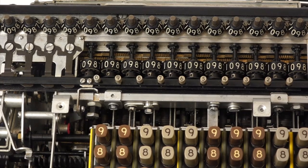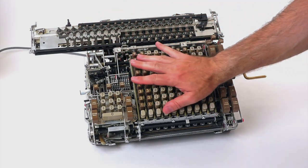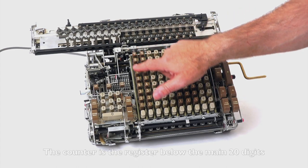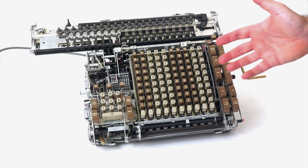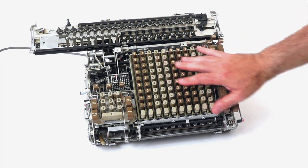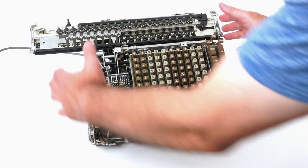This is very satisfying. The first thing to notice is that there is a different number of digits in the different sections of the machine: 20 digits in the accumulator, 11 on the counter, 10 columns of digits in the main keyboard. The multiplier has 10 digits, and this is something quite usual that you see also in computers. Multiplication registers usually are twice as large as the main bit width. The multiplication of two 32-bit numbers will give you a 64-bit result. Here the Frieden can multiply two 10-digit inputs, and therefore needs a 20-digit result accumulator.